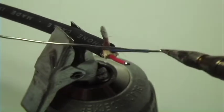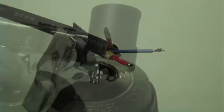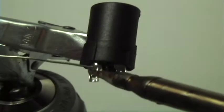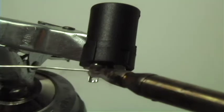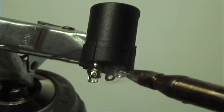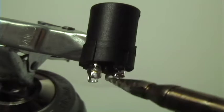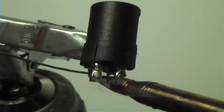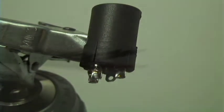You always want to tin every wire before you solder it. Typically you just want a little bit of solder on the very end of each wire. It's also a real good idea to tin the connector itself. You want just about the same amount of solder, and you want to make sure you get all the terminals. This is a good spot to check your solder. A glossy solder means that you've got a good temperature. If it's real dull, that means your soldering iron is too cold, and if it's burnt looking, obviously it's a little bit too hot. It's a good idea to remember to put your rubber boot on the cable before you solder the ends on, because then you'll end up scratching your head later figuring out how to put your connector together.